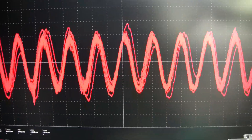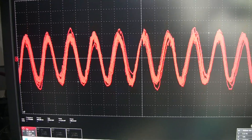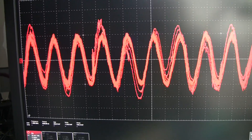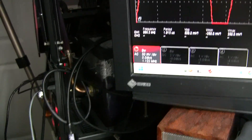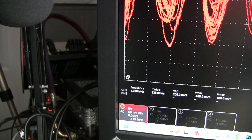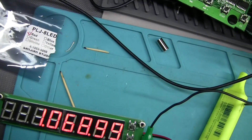That's the output of my probe, and here we can see that it is not as clean as the generator signal — there is some noise introduced. I'm not sure whether it needs better screening; the ground planes are probably not ideal. But the most important thing is it's working, and it's reasonably accurate. The oscilloscope settles on 1060 — yeah, it's exactly the same.